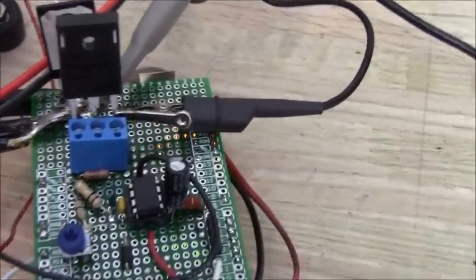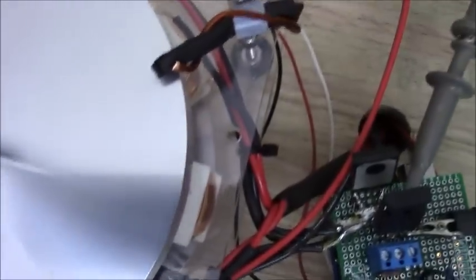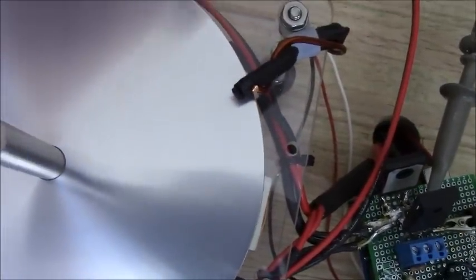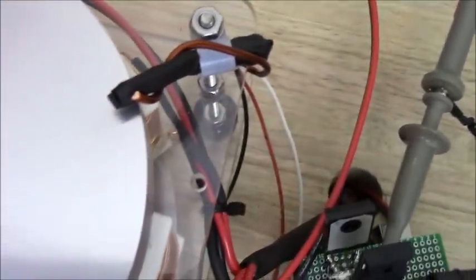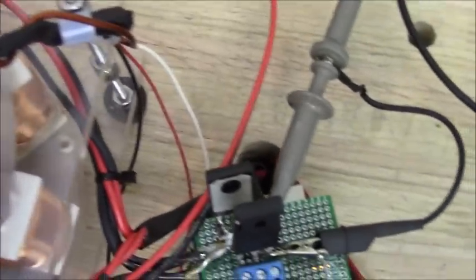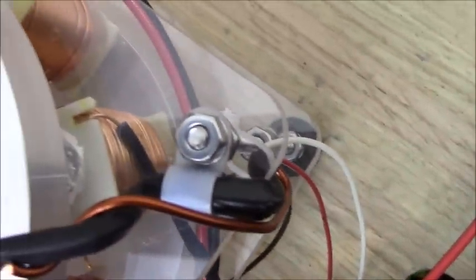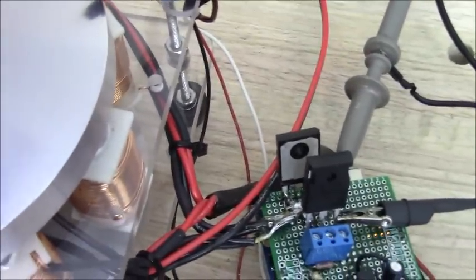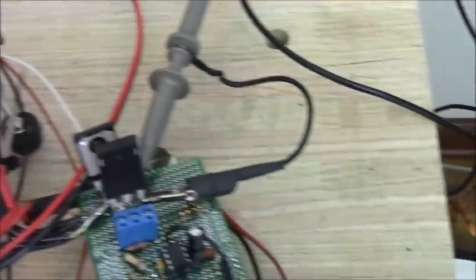It's a big mess here because I've soldered and unsoldered this many times, and I'm just throwing it together quickly, so it's Rick's mess of wires. You can see that the magnet would really correspond with that corner post. So we are actually quite retarded here on the timing, quite a bit after top dead center, because you can see the coil's position would be top dead center. We'll have to move that over more and more in this direction when we rotate this clockwise with the higher voltage.